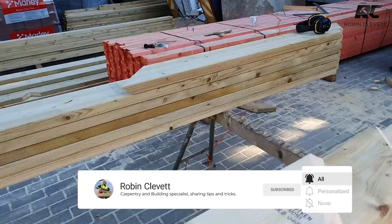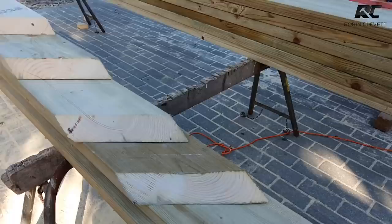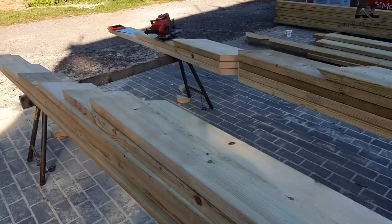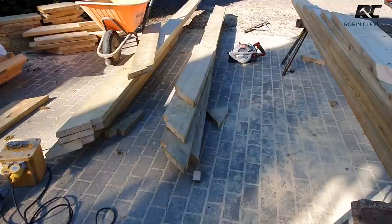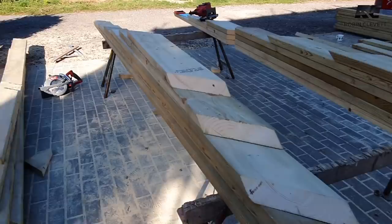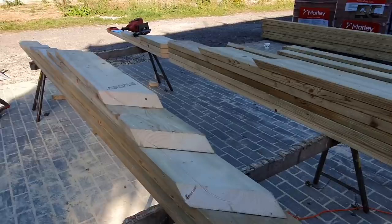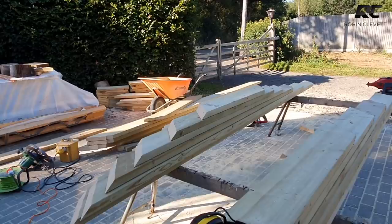It's taken at least an hour and a half to cut 28 of these rafters — there's a lot of measuring involved. We've got some with bird's mouths up halfway, which go over the ashlar wall. We've got four corners: two long pairs, two short pairs, and one long pair with the bird's mouth over the ashlar. When setting this out, you really need to think about which pair gets the bird's mouth, because if you get that wrong you've got to re-cut them all — and timber's so expensive nowadays.